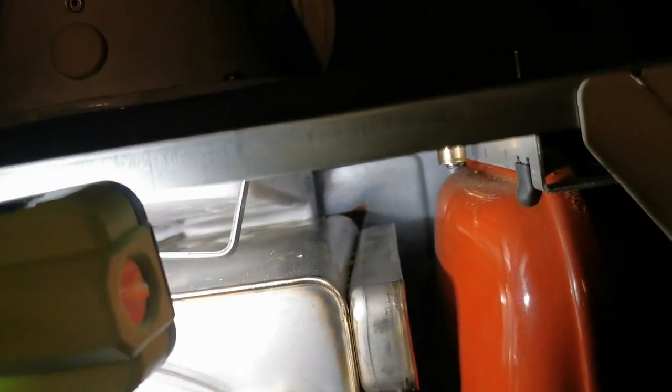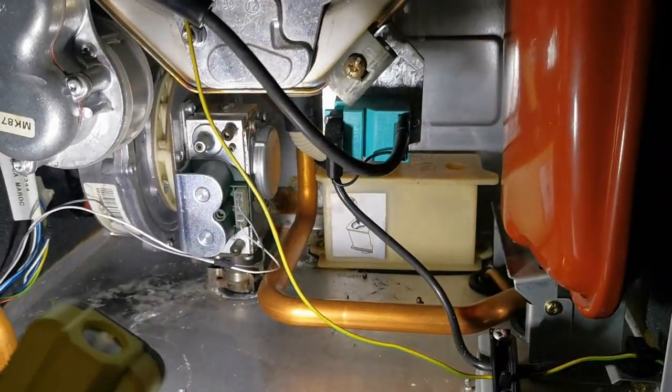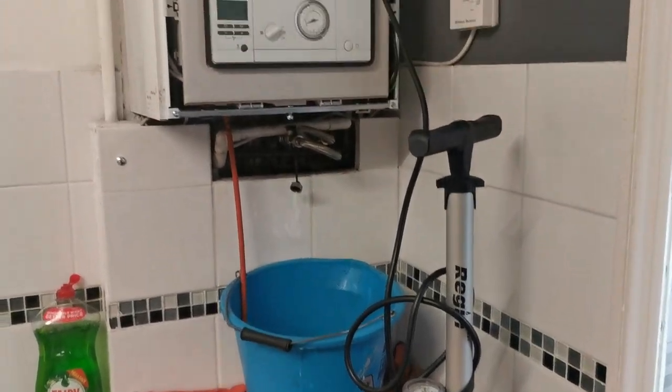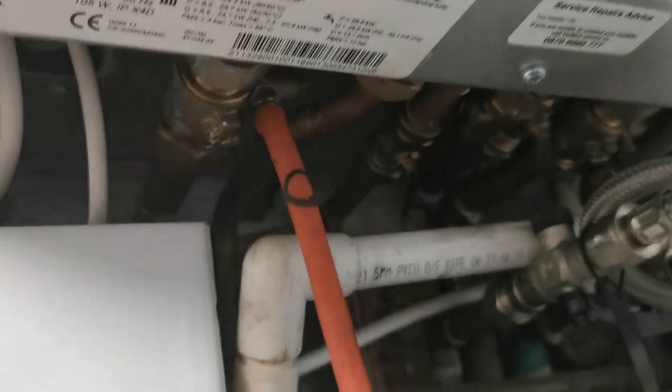The Vaillant and the Glowworms have a model which has a condense adapter that often splits or cracks under the heat - there's a weak point in it on the mold injection. I've taken a picture of this, so you want to check for this because it can be dangerous if not found. Run your mirror around the back of the boiler - it shouldn't steam up or be wet. Or you can put your analyzer in there; you shouldn't be getting any readings. Keep an eye out for rust on the boiler and run your lights around that, making sure it hasn't rusted through the casing causing it to be non-room sealed.